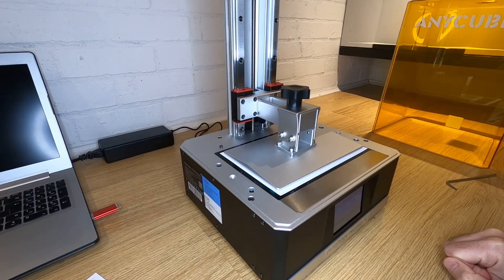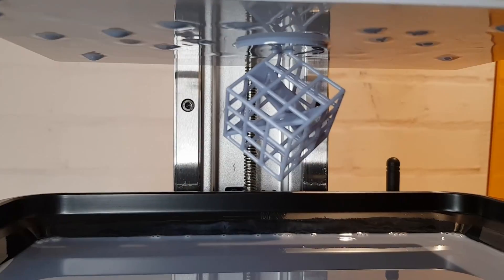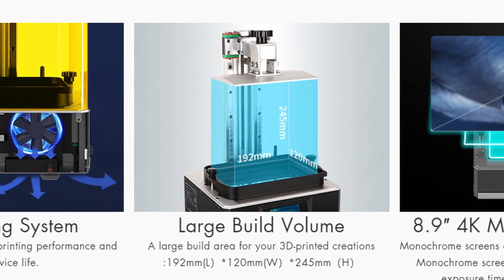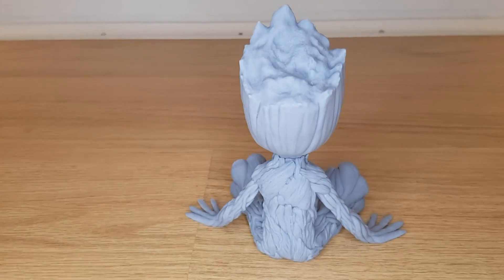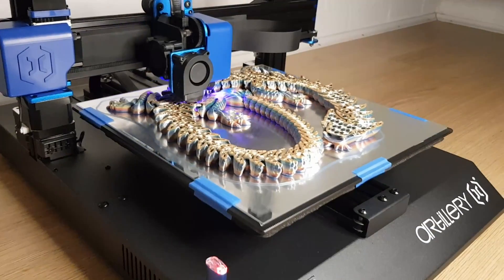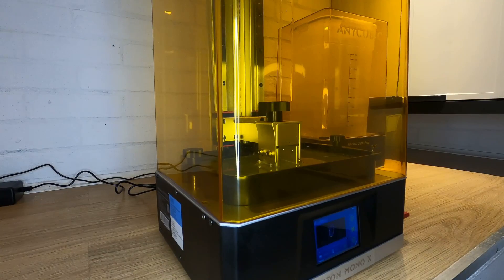All in all I've really enjoyed my first few weeks of owning and using a resin 3D printer. Most of the challenges I've had to overcome are because of the way resin 3D printing is done and not specifically caused by this 3D printer. The Mono X uses a 4K screen — not to be confused with the Mono X 4K, which is a smaller unit. There is also a 6K Mono X which is a little bigger, so there are plenty of options to suit your budget and size requirements. The model I've been using has an 8.9-inch screen and a build volume of 192 by 120 by 245 millimeters high. The Mono X uses a monochrome LCD screen, which in basic terms means faster print speed and the screen should last a lot longer. I'm told that eventually screens do wear out, which is another reason to turn down your UV power — you should still get thousands of hours out of each screen though.